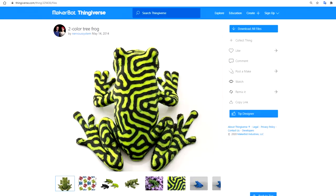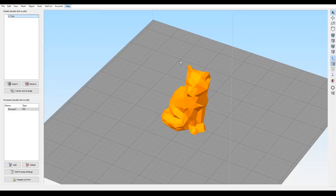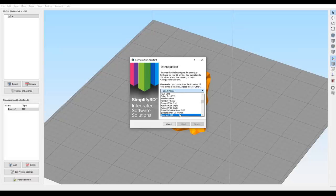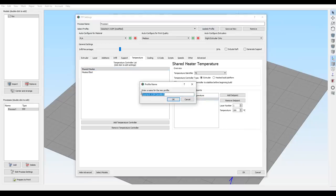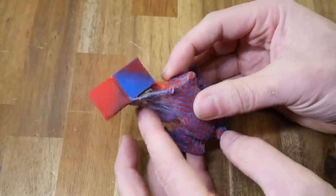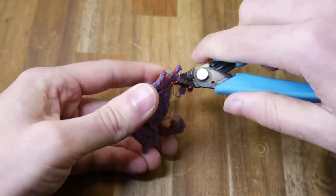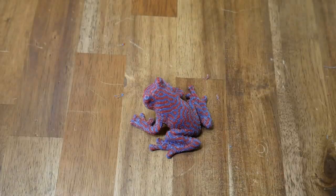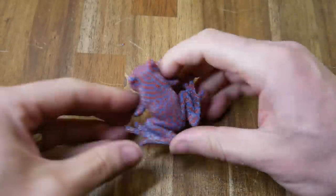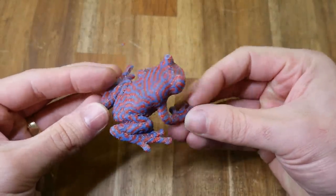Of course, with this modification, your printer is now capable of traditional dual extrusion printing, and I've previously made a guide on how to set up four different slicers for just this. In Simplify 3D, you can't just add an extruder to an existing profile — instead, you need to import one that already has it, in my case the GTEC A10M, and then manually copy over all of your print settings to the new profile. This one turned out okay, apart from the excessive stringing, but I put in no time to fixing this. To inspect what was underneath, I started some clean up using a combination of a heat gun, side cutters, and a sharp blade, and the final result was actually decent. Remember this is an uncalibrated first print, and it's quite a torture test at that, with many small segments and details.